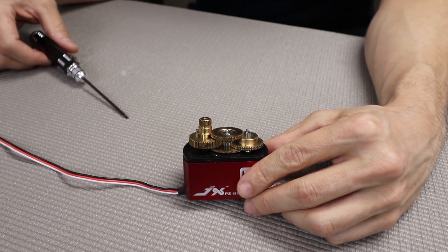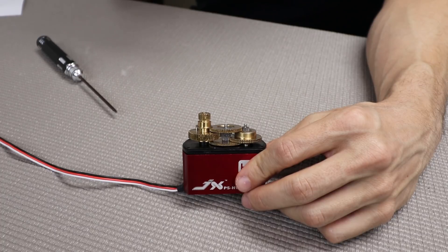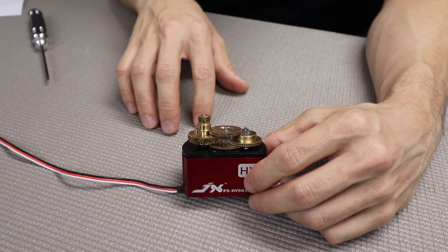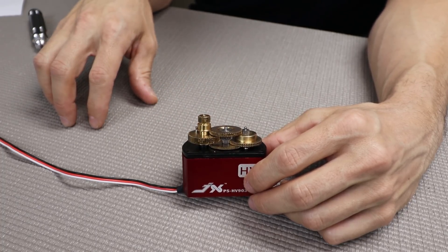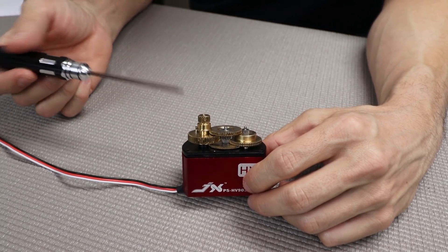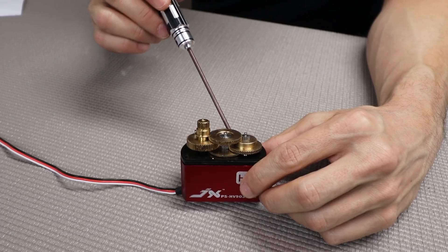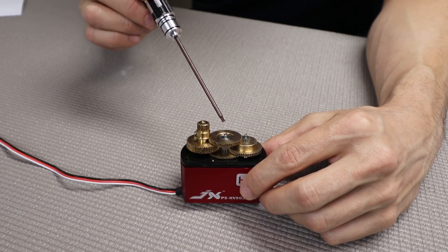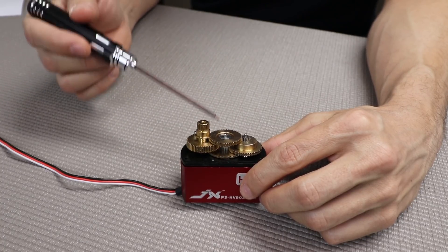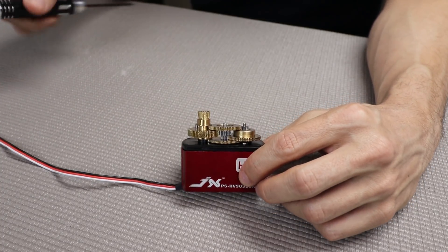You may have noticed if you ever look at specs for servos from the same company — servos that are similar to each other — there are several similar models, and in general as the speed goes up the torque goes down. The reason they can do that with very similar servos is, again using the example of our RC cars, just by changing the gearing. So if you change the gearing — go with a smaller drive gear and a larger driven gear — that servo is going to make even more torque but go a little bit slower. They're just re-gearing servos to get different characteristics out of the same servo body.